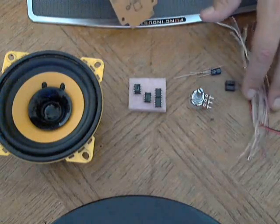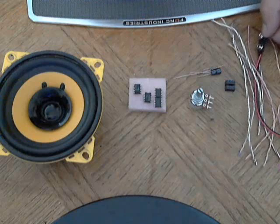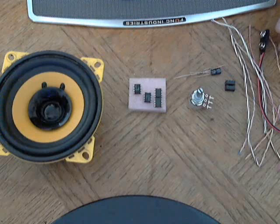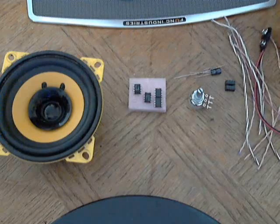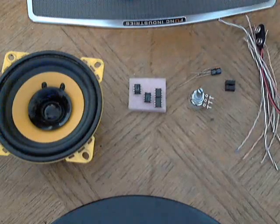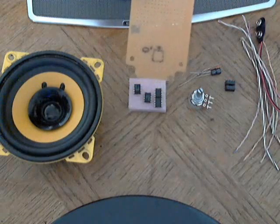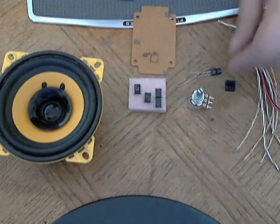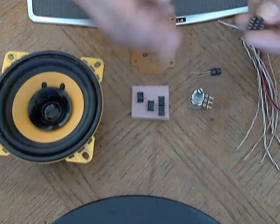The things you're going to need is some extra bits of wire. I'm using a 9 volt — you can literally use any power supply from about 5 volts to 12 volts. They say 6 to 12 but you can get away with 5 sometimes. I like 9 volt just because it's small and it's pretty powerful. You'll need bits of wire, some kind of power supply, battery clip, whatever you're going to use. A circuit board — this is just a prototype board. LM386 chip of course, just one.